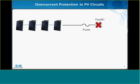But let's look at the second scenario where we have a fault that comes after the fuse. So you have a string of modules, a fuse, and then a fault. Will that fuse provide any protection? And this is important because in a typical AC circuit, it would. If you have a fault after a fuse, the fuse will blow and clear that fault. But in a PV circuit, it will not. It actually does not provide any protection against that fault. And this is the reason why.